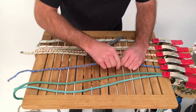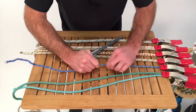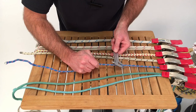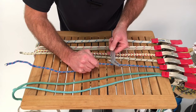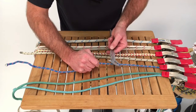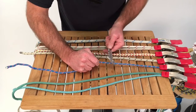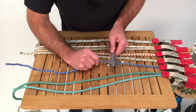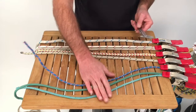This line, I'm a little suspicious. It feels like it could be undersized. It looks like a 1/4 inch to me. So I close my calipers down. And you'll notice I've got my thumb back here. I'm keeping a slight amount of pressure on this. I'm not pushing. I just don't want this to get pushed towards me and give an inaccurate reading. So, no, this is pretty spot on, right at a 1/4 inch. All right, so I've got 3 lines.